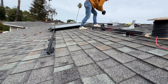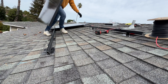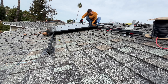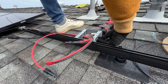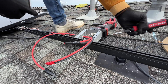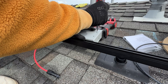Now I have two panels installed and connected in series, with two wires coming into the junction box — positive and negative. Now we can install two additional panels, connect them in series, and all of them are going to be parallel in the junction box. The owner is planning to run wires from the junction box to the power station himself, so I'm just using a cap right now. In the junction box we have two positives and two negatives, and we're going to parallel the strings right here. Now we can attach the weatherproof cover and install the last panel.